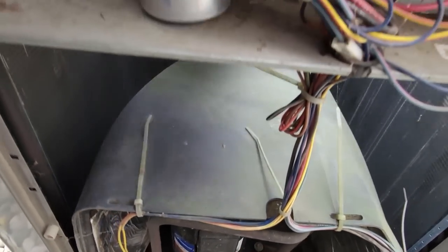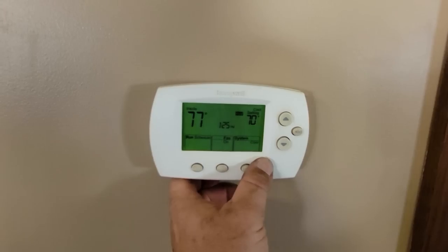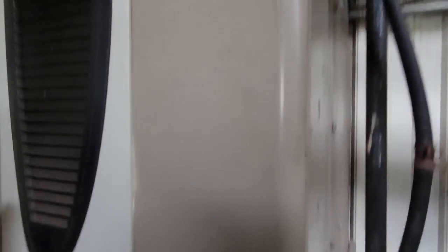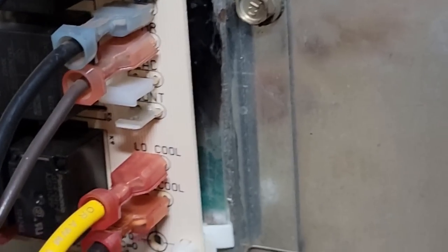Compressor appears to be pumping. Let's go back inside and see what's going on with the thermostat. They're more worried about the downstairs, but we're going to focus on that one first. Yesterday it apparently froze up all the way back to the unit. It sounds like it's probably low too, but it's at least 20 years old or better. They've already got the filter out. The blower's not running - he said something about the blower was just replaced. Oh look at that - that sure looks like a black spot behind here.